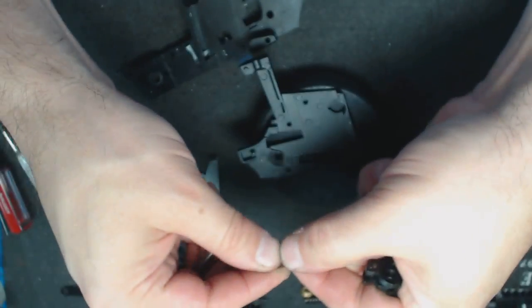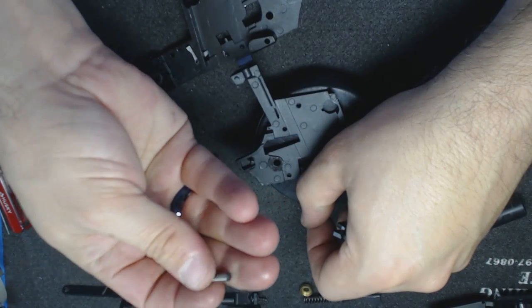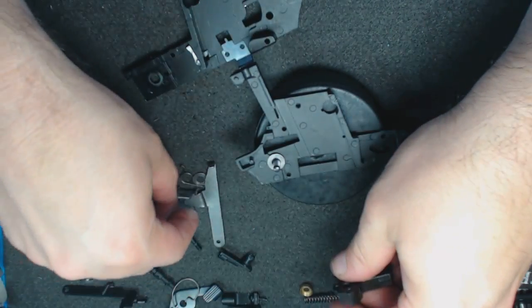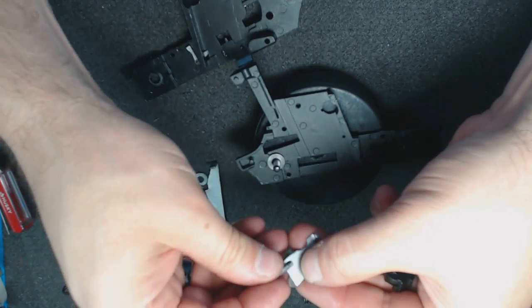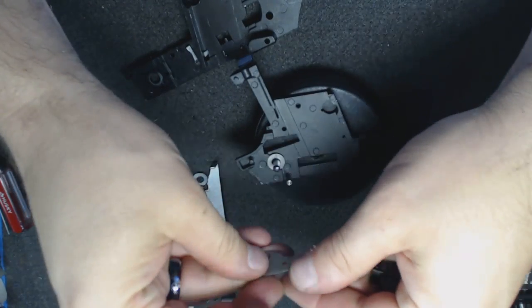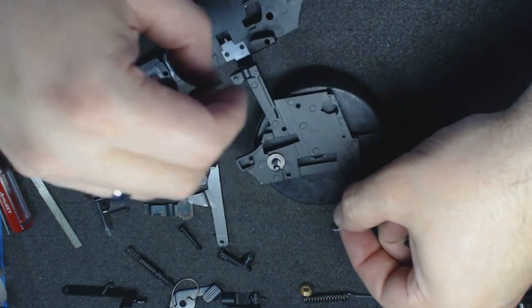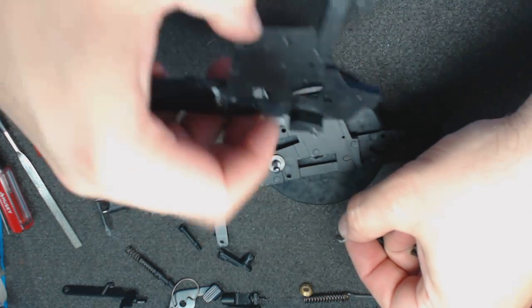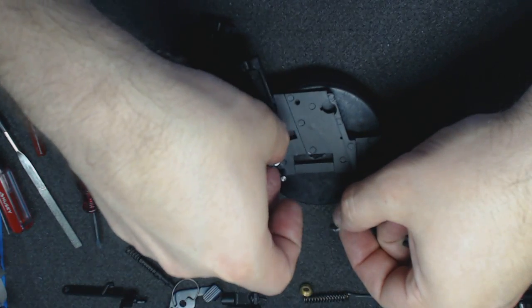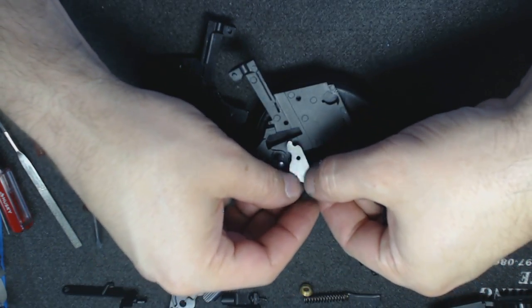So we are going to do it by setting. The hammer pin has one end that's far more tapered than the other. We're going to use that to our advantage by putting that end up so that when we go to get the clamshell reassembled, that's essentially already in place. This pin seats in the frame. It only goes one way. The big end will go through the other side of the frame, like that, and then the little end actually seats in the frame here. We don't want to put this on yet. Silly me. Till we have this piece in.